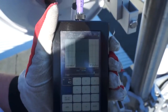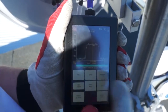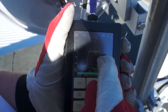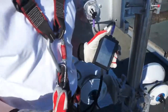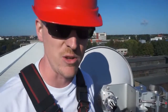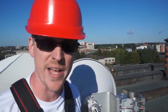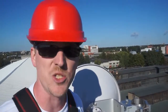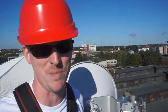So I've got this link perfectly aligned. I can also hit the save button, and it will save this screen for further analysis — showing both that the radio is transmitting a 40 MHz wide channel and that I was able to hit my target RSL. With that, I've completed this alignment very quickly within 5 minutes, instead of an hour using a multimeter trying to figure out polarity. Being able to align this link without the radio transmitter present has greatly sped up the process to commission this link and get it online. So that means I can get to the pub and drink my beer that much quicker. Thank you.